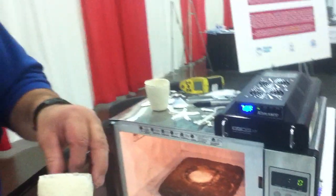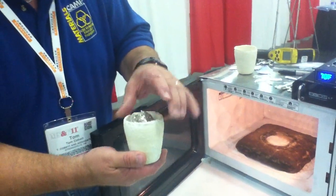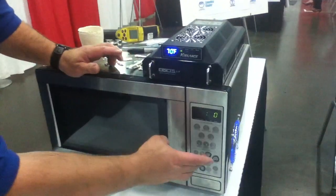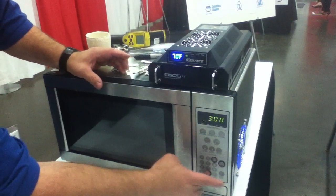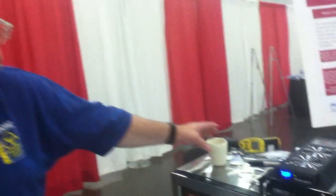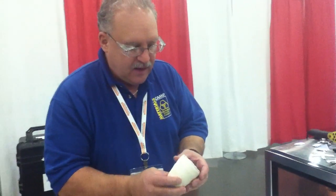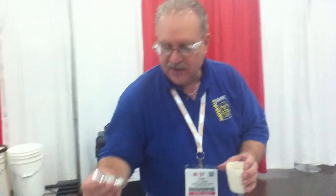I'm going to take one of our containers and put some tin metal into it — some scraps — put it inside, close it, and turn it on for about three minutes. During the three minutes, we will bombard this crucible with microwaves. The material in the crucible absorbs the microwaves and will get red hot. It only takes about 450 degrees to melt this metal because the metal is pure tin. We use tin because it's very shiny, it doesn't corrode, it has a relatively low melt point of 450 degrees, and it's non-toxic.